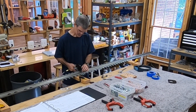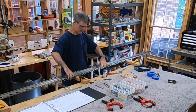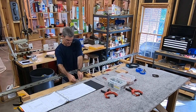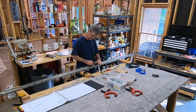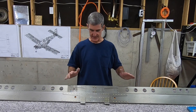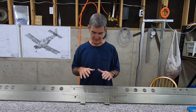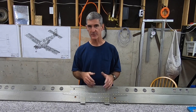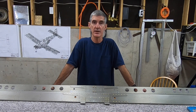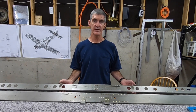The last step of the horizontal stabilizer front spar: there are 9 rivets on top and bottom to hold the spar cap to the spar flange where it will be inside of the tail cone and there are no horizontal stabilizer skins. And that's it! So that was about 7 hours worth of work. It doesn't seem like that many rivets, but there are a lot of different sizes, lengths, and thicknesses of material to go through. You've got to keep adjusting the squeezer for the different lengths, and mainly you just want to take your time, not rush, and make sure you put the right size rivet in the right hole. Everything went well - I didn't have to drill anything out and I'm really happy with how much I got done.